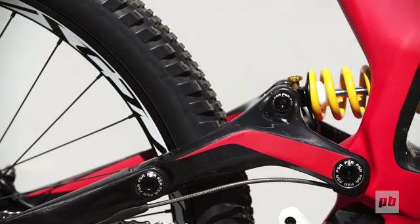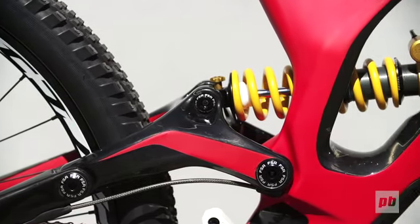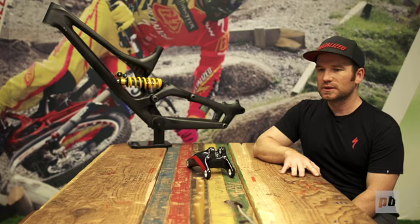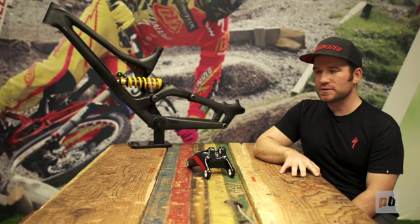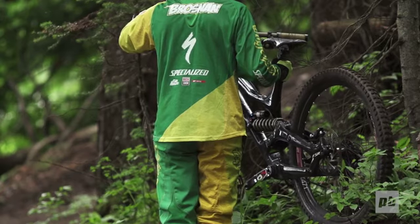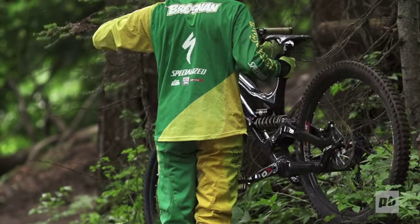To address the strength issues of this link, we designed a link that's made from one piece. It's hollow in most places, and there are some key internal carbon ribs that add strength where needed. So the key function of this link is to transmit forces through all the bearings that are pressed in. And we didn't want to press the bearings into the carbon for reliability. So we've designed aluminum in-molded parts that are mostly machined out. There's just a thin wall of aluminum that helps support the bearing and increases the strength.